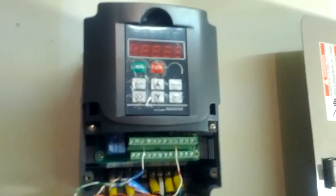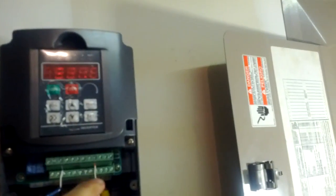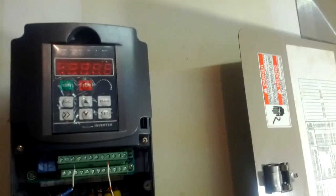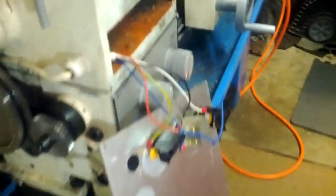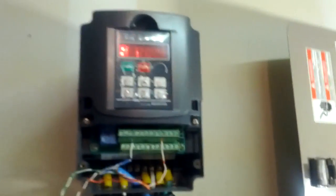I have DCM hooked up going into my cat5 shielded cable here, and I'm using the forward output on my orange cable going down to my little wiring block, which I have looped through my emergency stop to the forward and reverse switch. Right now I just have the forward switch hooked up to the VFD. I'm going to go ahead and turn the VFD on and try it out.